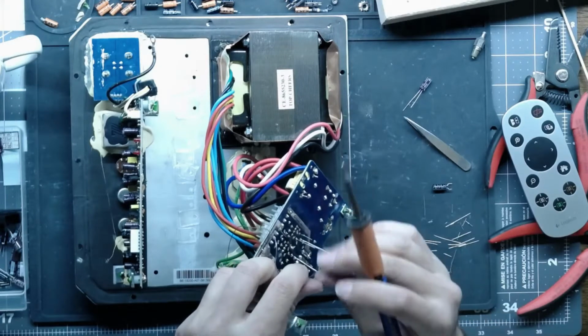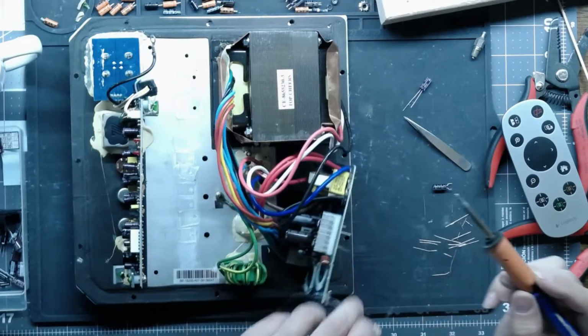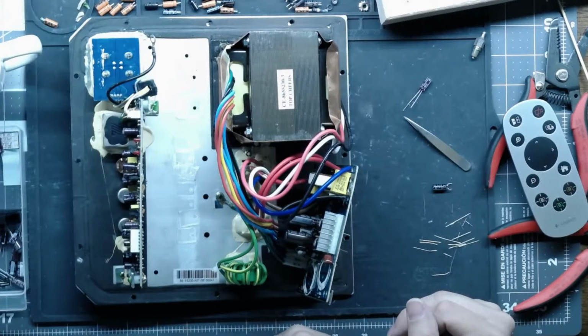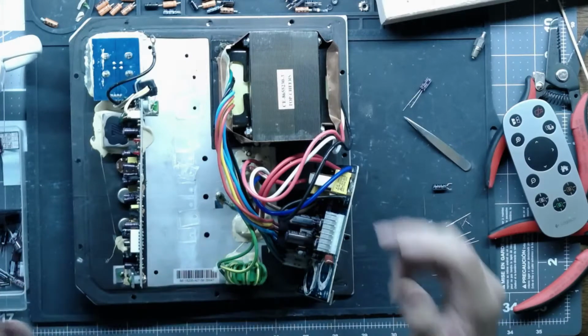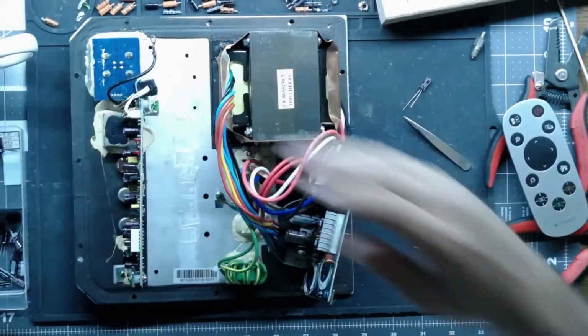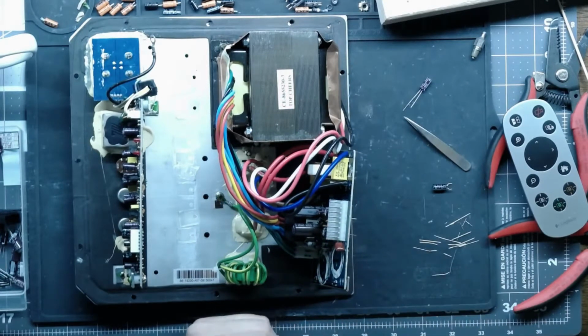It's interesting that this actually uses a transformer now that I think about it, because all the other SUNFIREs just use direct line voltage. I can't think of any of the other ones that use one. The amplifier circuit and probably the preamp are the same, but the power supplies are a little bit different up until this. I mean, it's a lower power amp, I guess. But you would think the transformer would be more expensive than the down converter or whatever they call it. Especially having 3 separate circuit boards in here with the transformer. I'm kind of curious why they went with a design like this.